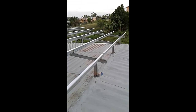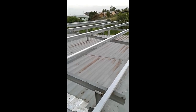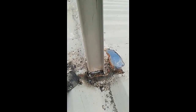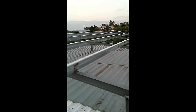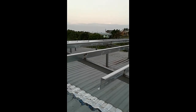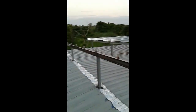So on the third day, we did not exactly complete, but we made all of our welds extra solid, secured everything as best as we could for the I-beams, tacked in the majority of the Z-purlins before we have to bolt them in. This is just so we could size up for the material we need to do the actual roofing. Right, that's Z-purlins. We still have to cut and install 11 more to fill this section.